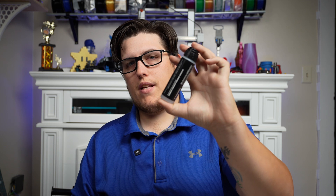If your prints still aren't sticking, you might be inclined to go for a band-aid fix and use something like hairspray, glue stick, or a purpose-made bed adhesive. Those are all good solutions and potentially useful for insurance on certain prints — we'll talk more about that later. But if parts aren't sticking to your factory print bed, chances are there's something else going on.